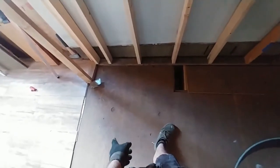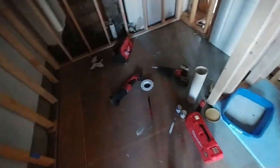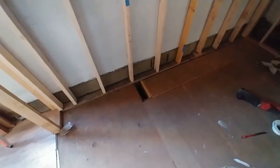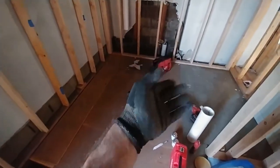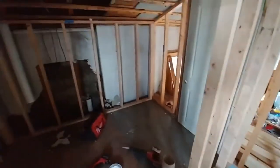So he's going to need another big layer of something in here, a thick layer of something, and then he can tile. And I got to shim up the toilet flange so that when he gets there with his Schluter and everything in the tile itself after the extra subfloor, it's not buried down beneath that. So we got to decide what will be going down and then put the flange up appropriately so that when it's covered, it's sticking up the way that it should be. Lots to do. Maybe shouldn't have bought all this plumbing stuff so fast.